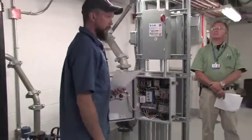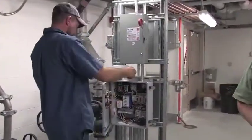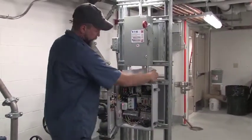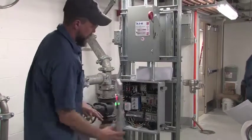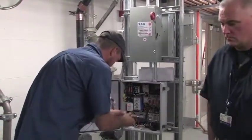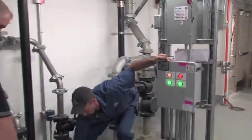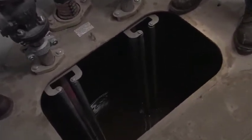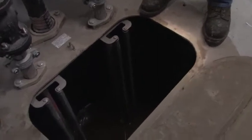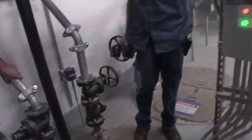Click these on and I'll jump it out. Right now the lead pump is being called on and the high water alarm because we filled the pit. I'll initiate the lag — so there's lead pump on, number one right now. Jump the circuit and get the lag to fire off. So you've got lead, lag, and your alarm all initiated. Down the hole — that pit got pretty high. Those are your floats. Again, four floats: bottom one is standby or ready, second is the lead pump, third is your alarm, fourth is your lag pump. The high water alarm is already out — it's been cleared.